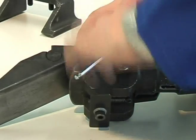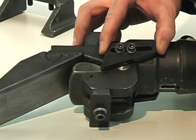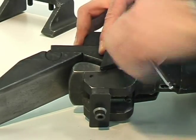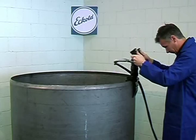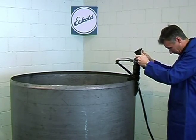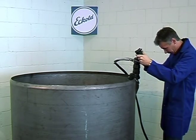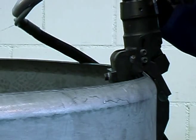After the first pass, the adjustable stops are set a little bit forward. The tool is always guided along the rim, no matter how large the cylinder is. Different diameters can therefore be formed with the same tool.